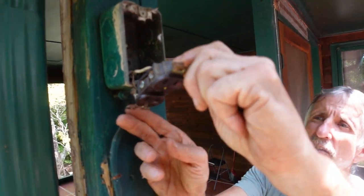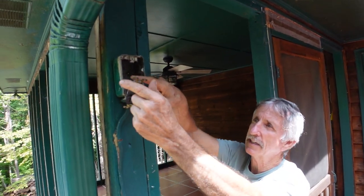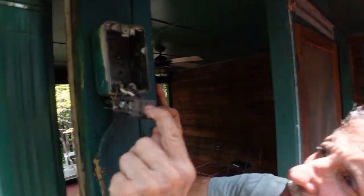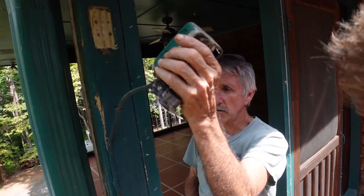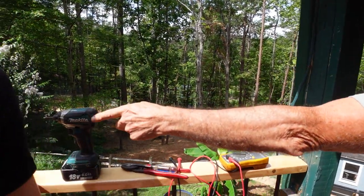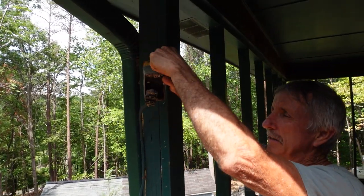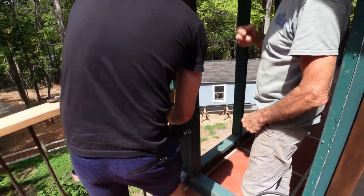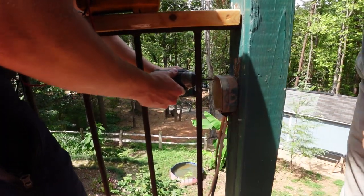You'll notice sometimes there's a whole lot of wires in there. When you go to put it back in, you bring it down like this, push the wires down, then push the outlet up so you get an S shape on your wires and the outlet will fit in. Now the names of these things: this is the outlet plate — it has a rubber gasket on it because it's outdoors — the gasket is shot. This is the outlet itself, this is the outlet box, and of course this is wire.